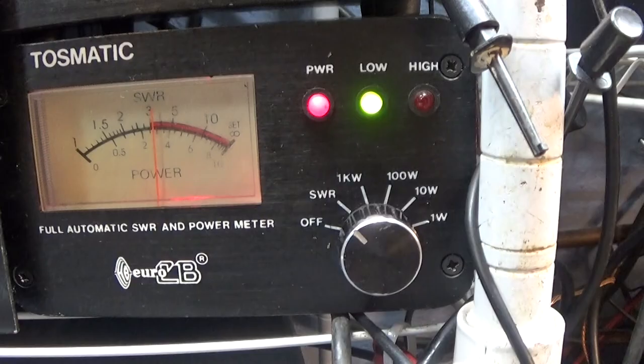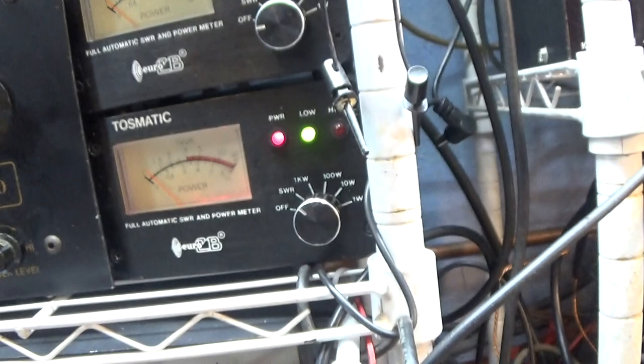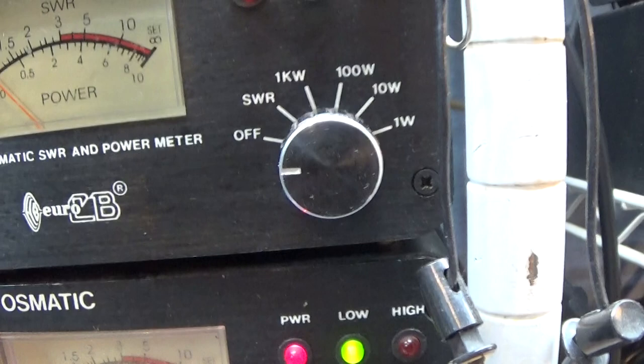You can put it on watts — 10 watt scale. I'm doing a little under 3 watts going into the amp. So about a little under 3 watts is my input SWR going into the amp. If I turn the amp off it goes back to the dummy load and back to that 1.3 match going into the dummy load.